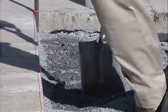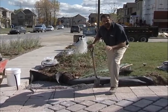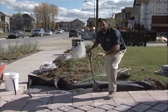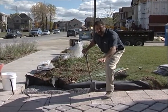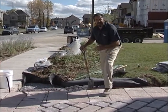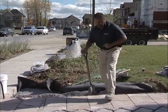You'll also notice I have a solid laid header course. Techoblock's the only manufacturer currently recommending a solid laid header course on a permeable pavement. The reason for that is we're retaining our joint fill, keeping it from migrating out, and keeping our erosion and sediment control measures in place.